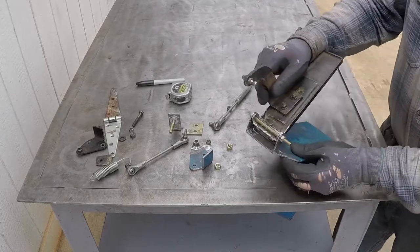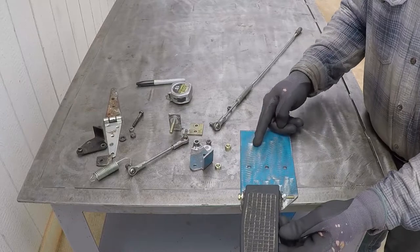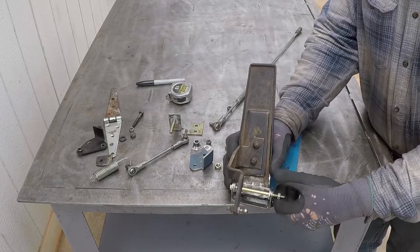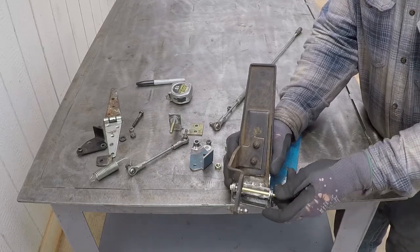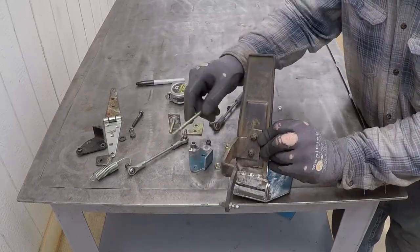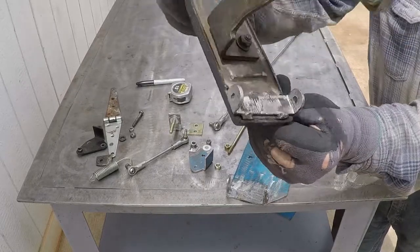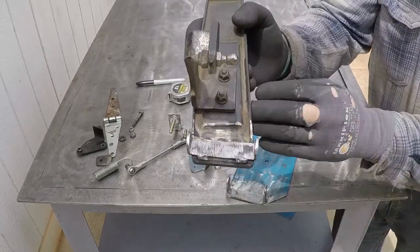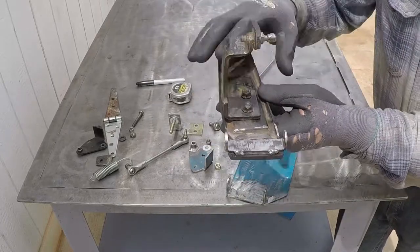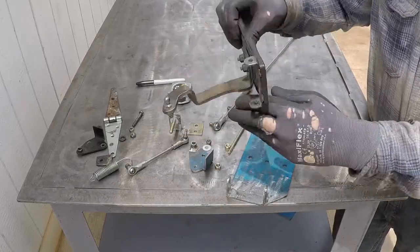I also did this. And I will trim this if I have to on the machine when I get to the truck. I'm also using a grade 8 bolt. I bent this flat stock to this shape and I drilled it. And I was able to weld it to this surface. I welded it very quick, and I have water on the ground, and I set this so I don't damage the rubber. And it came out great.